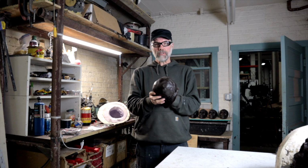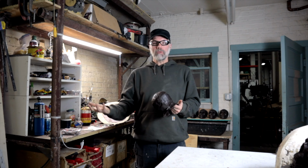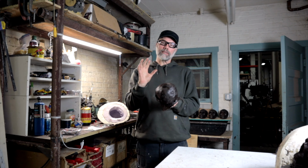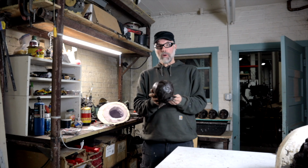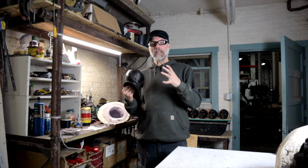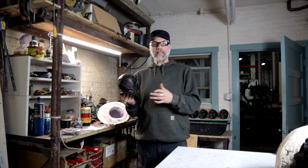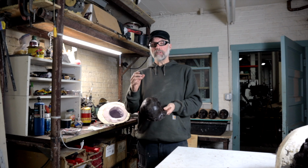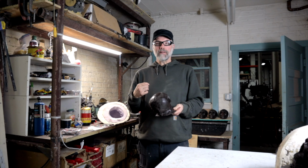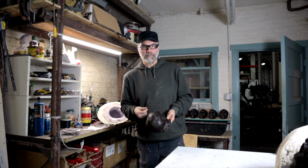It has a nice surface to it, but at the same time, we can heat it up under a heat lamp, or use metal tools and heat them up under flames, ultimately chasing this wax and getting it ready for casting. But we can also, as we're generating a variety of wax shapes, collage different waxes together and make larger, more complicated castings. This material has that versatility and that ability to be worked at a variety of temperatures and a lot of different plasticities, softnesses.